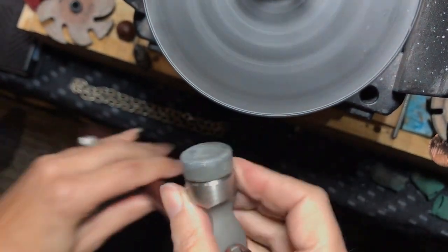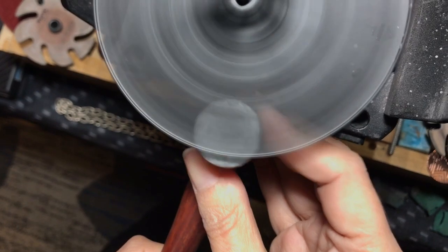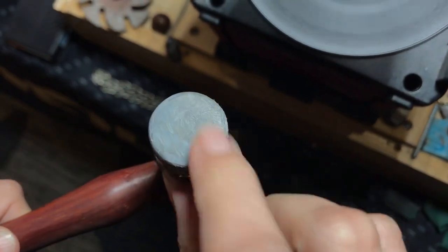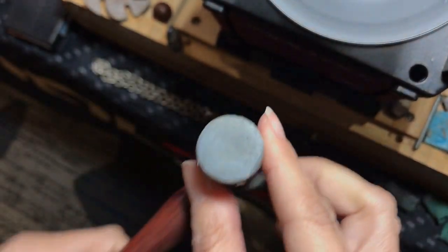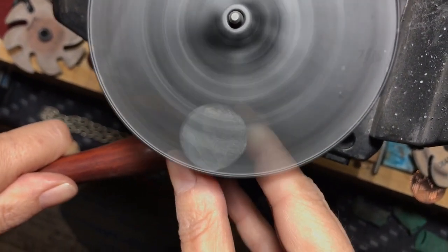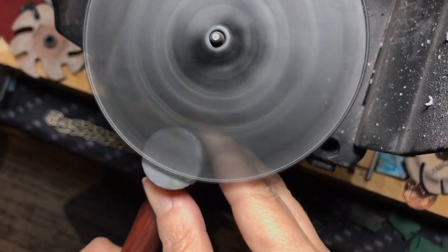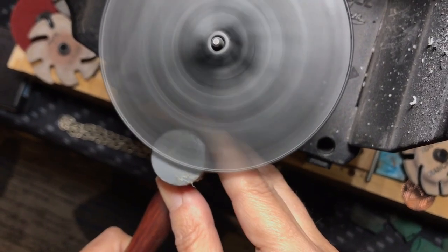I'm going to work my way in and then do the flat - or I can do the flat first. So right here we're going to get this nice and flat. Let's see how much we've accomplished. Remember this is only the fine. You can see it's really uneven - he's been hitting obviously at the tip more. So this has become uneven. Let's grind this so we get it even, back to original. I might have had to use a heavier grit but I didn't know about this. Things are looking good.